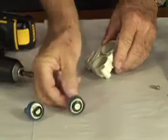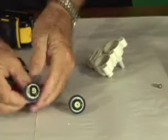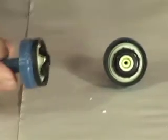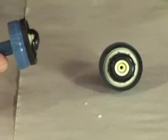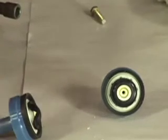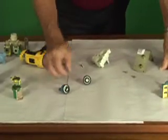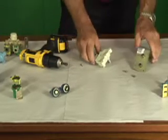But as you can see in this particular one, this control washer has completely disintegrated and breached and pulled off. That would allow water to flow, and it could be intermittent. We just couldn't produce it. It may have been after 10 or 15 or 20 cycles that it would have failed. But in this case, there's a complete breach of that internal washer. That's one example of the type of failures that can be discovered when disassembling for destructive testing.